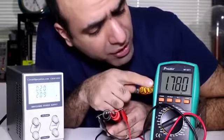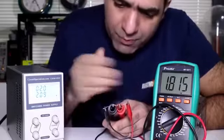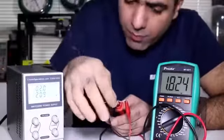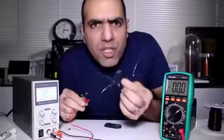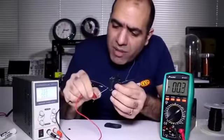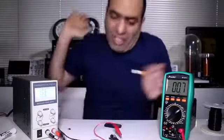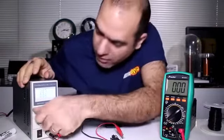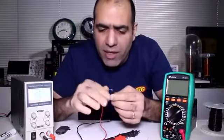Now the voltage reading here is actually showing that there is 1.8 amp running through it. It's burning now. So here's the shunt. Now let's do a comparison between readings of the supply's ammeter and our shunt. Who set everything at maximum? I guess I did. What can I say? I like extreme shit. And see if it gets warm.